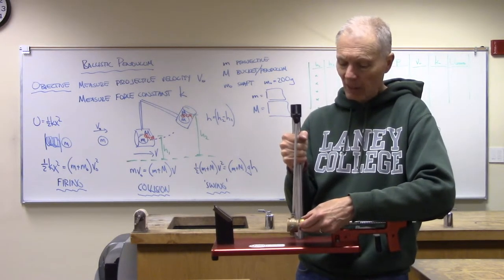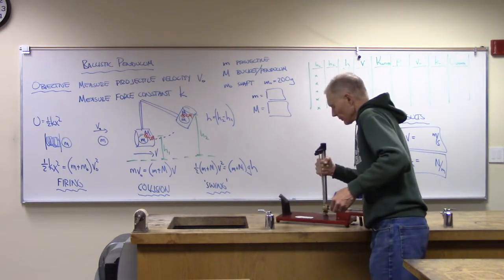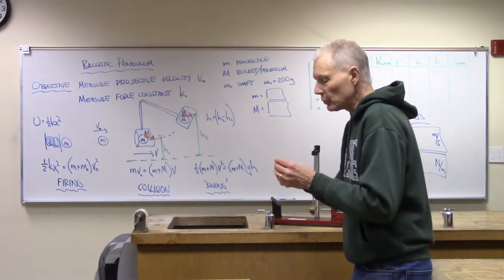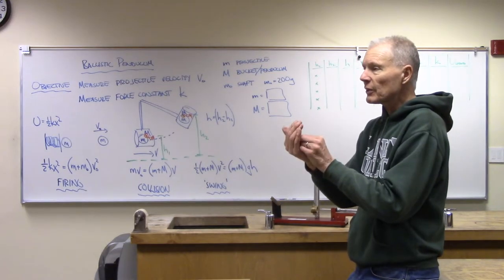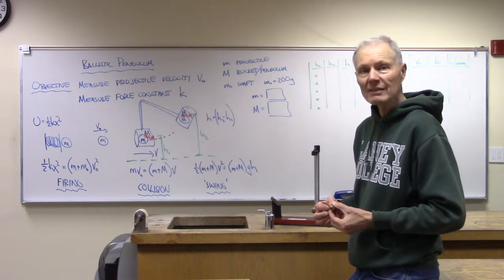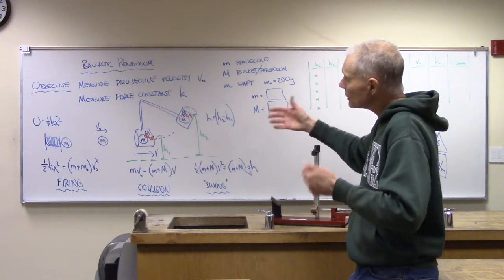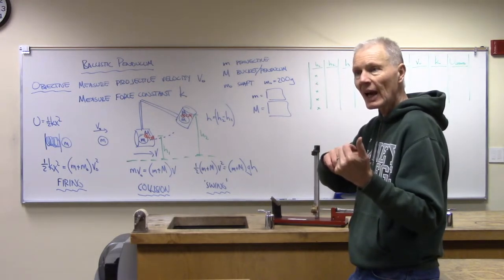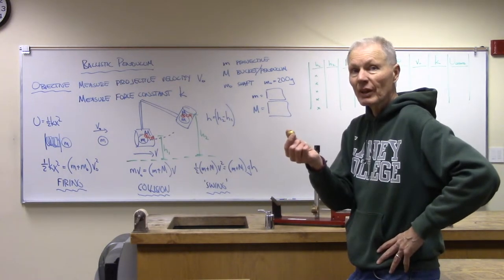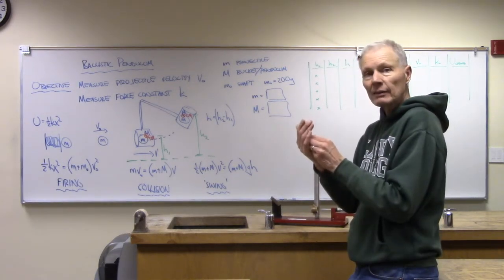When we fire it, the projectile goes into the bucket. The idea with the ballistic pendulum device is this: you can have a projectile moving at a pretty high speed, and then you run it into something which has a lot more mass, and that slows it down. We can use momentum conservation to calculate how the velocity coming out compares with the velocity going in — we can go back and calculate the velocity of something moving at a really high speed, which might be difficult to measure directly, by running it into something heavy and then measuring the slower speed.